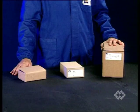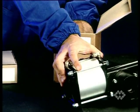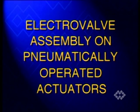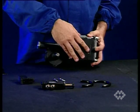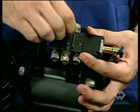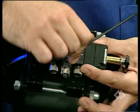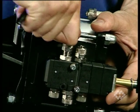Handle all material with care. Remove all parts from their packaging and note the assembly instructions contained in each package. Fix the mounting plate onto the actuator. Fit the electro valve to the mounting plate using the two screws supplied. Connect the compressed air pipes with the fittings on the actuator and on the electro valve.